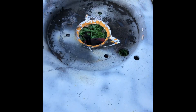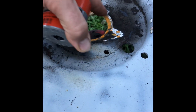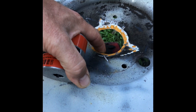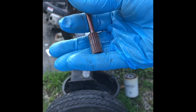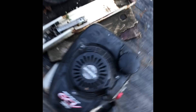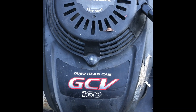I had to make that hole much bigger — cut it, torch it, grind it. Whatever you need to do to enlarge the hole with a hole saw is going to be quite difficult. I ended up using a grinder, and then I had some additional heavy-duty grinder bits that went on my drill, and I went around and cleaned that out. This is the bit I was using to grind that hole a little bit bigger. It was probably off a push mower, and it just works.